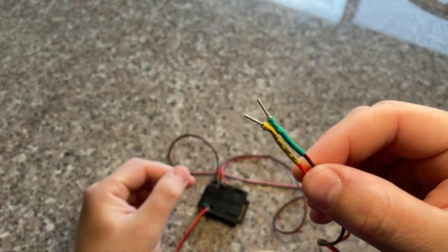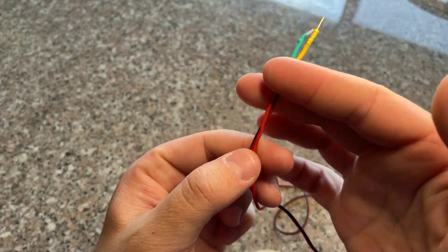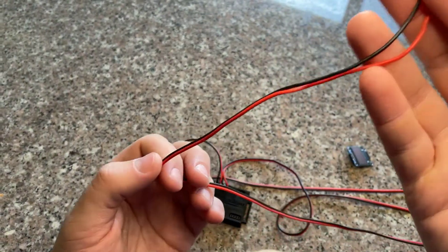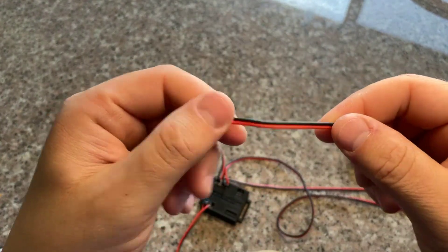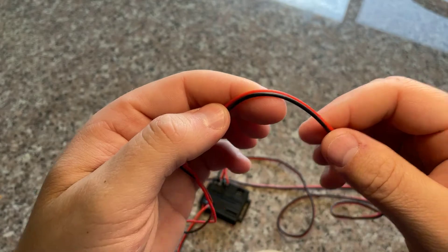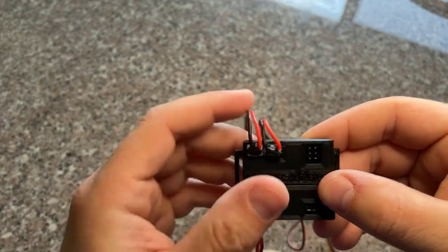This is the power cable. On the end I've created some mirror taps so you can very easily tap power from the mirror. If you want to hardwire it, you can cut the ends off and attach to a fuse. I give you six feet or better of wire — it's a really nice silicone wire, which makes it super easy to fish through things without snagging.